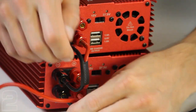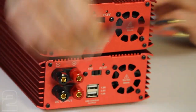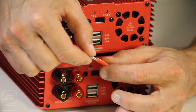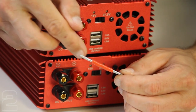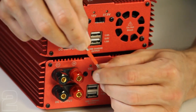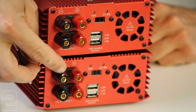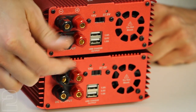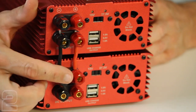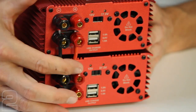Another option — to connect up to four chargers — is to remove the outside jumper and use your own custom binding posts. Take chunks of 12-gauge wire, strip them back with protection between the two sections but with nice exposed posts that allow binding posts to go down deep. Tin them and wick rosin-core solder up into the wire, effectively creating two high-current binding posts. Put them between the upper and lower terminal posts, and now you have eight banana jacks available to connect up to four chargers.